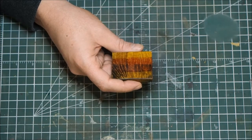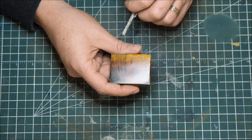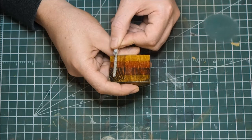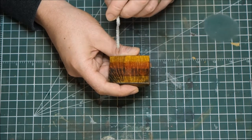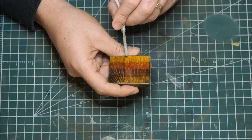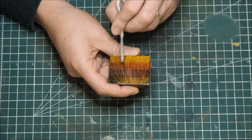I want to walk you through the end results of this little experiment. This is the piece of wood — it's now been sanded, it's somewhat smooth, and it's also been waxed with Carnuba so it's kind of shiny, since I wanted to get it somewhat close to what a real pipe finish would look like. This half of the piece is the bleached portion; this bit is the unbleached portion. If you look at the area where I just did a straight yellow and a straight red stain — especially in the yellow — the dark tones in the bleached area are much darker than in the unbleached area. Same for the red. It seems that the dark tones go darker while the light tones stay pretty much the same, so you get a bit more of a contrasty look.